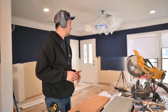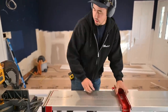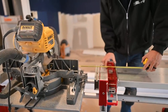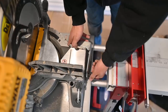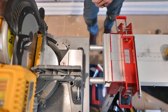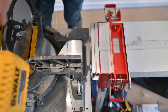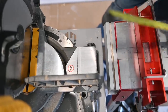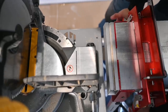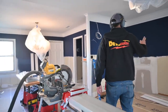So I figured out the math on our mid rails and it's gonna be 18 and 3/8 inches for every single mid rail. I'll set up my stop block for 18 and 3/8 the same exact way I did before. I'll take off this little crown stop and slide the saw over a little bit more — yeah, we're good right there. Perfect. So we'll cut one, two, three, four, five, six of those.